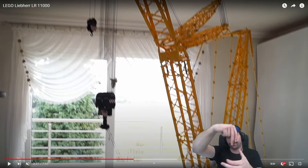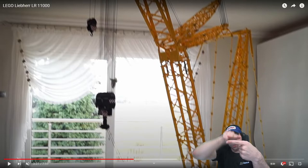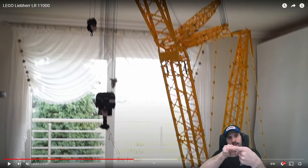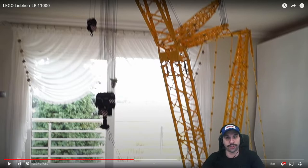Those pins are designed for what's called shear load. If you have a pin and you have a hinge moving on that pin, the pin is designed to have load put on it perpendicular. Once again, that's called shearing. These things are perfectly designed for that. In fact, I don't know, these might not be hydrostatic. I don't think they are, but sometimes they could be.